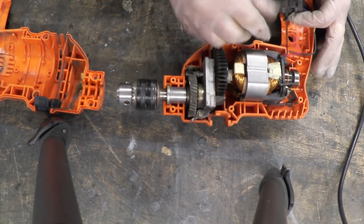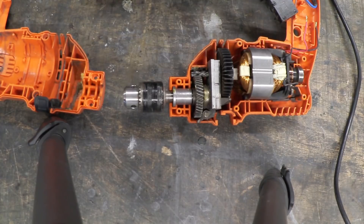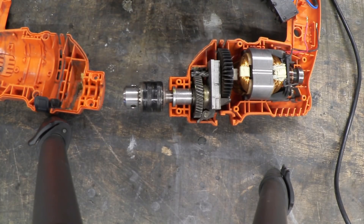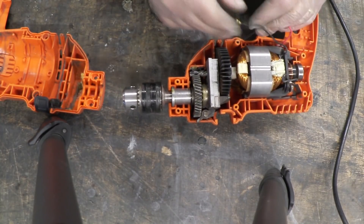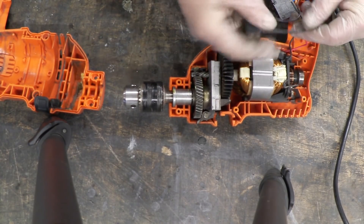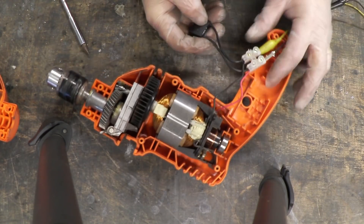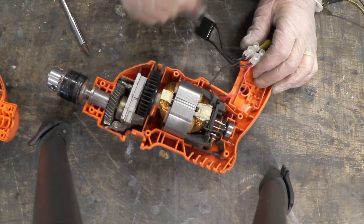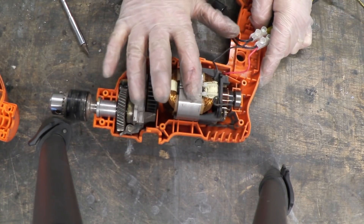We remove those two wires and the switch. Now if we just connected that to positive and negative nothing would happen — what we need to do is put a capacitor across those. So we're going to put that capacitor right back where it came from. All I've done is connect that capacitor across the positive and negative, and then take the positive and negative to a DC power supply.